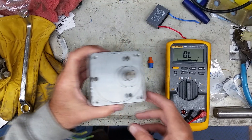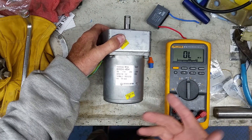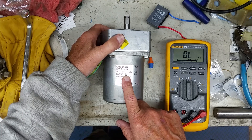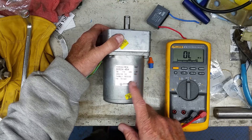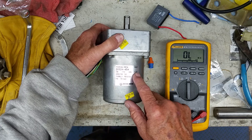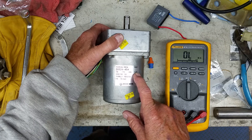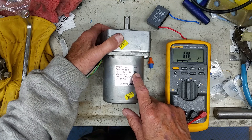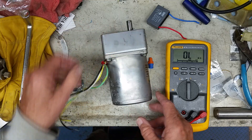The motor I'm using is a geared head motor, reversible direction. It takes a 12 microfarad capacitor, 115 volt single phase, draws a little less than an amp, 32 watts — though those two don't work out correctly. If it's 0.85 amps, that's closer to 90 watts or so, not 32. I don't know why they get 32 watts, but anyway, either here or there.